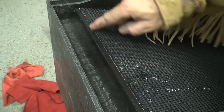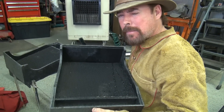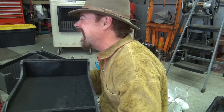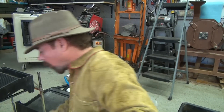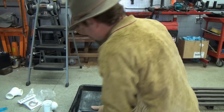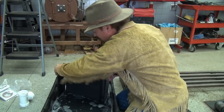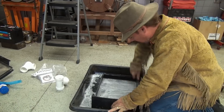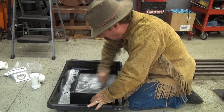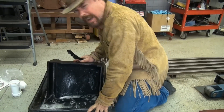If the back side is a little high compared to the low side, just adjust the legs — that's how you know it's level. Now, when you first buy one of these, it's going to have oils all over it from manufacturing, and if you know anything about oil and water, they don't mix. So get yourself a mortar tub like this one, put some soap in it, and wash that thing really well.